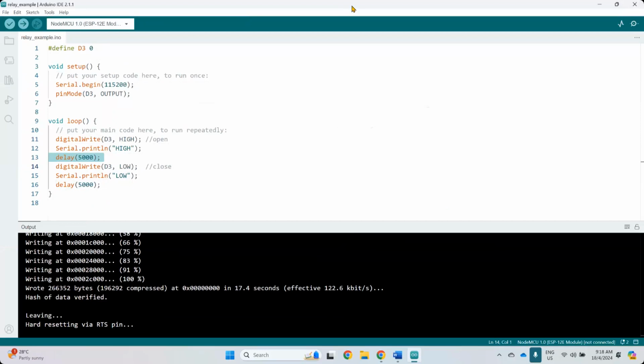You need to connect to the internet, to Wi-Fi, with an ESP8266, and you can use ESP32. Power requirement: you have to understand that Wi-Fi uses a lot of power. When Wi-Fi boots up, it will require about 200 milliamperes, what we call a spike, when it starts to connect to Wi-Fi. But it will go down to 70 milliamperes when it establishes the connection, because you have the handshake and everything to the router, to the switch.